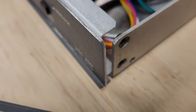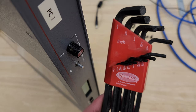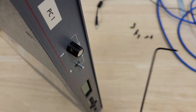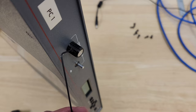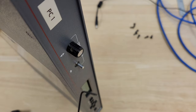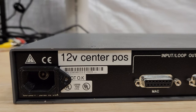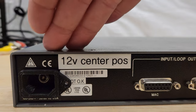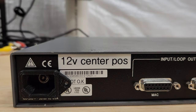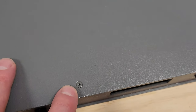I just wanted to reiterate the build quality on this Extron stuff - look at this groove in the top plate, it slides into this piece perfectly. This thing is just super well built. Also, a note about hex key sets - standard and metric - you wonder when you'll ever need the tiny ones, and sure enough that's what fit the set screws on these knobs. The most important part of the mod is a label reminding myself this thing expects a 12-volt center-positive barrel jack, because nothing about the case says that.